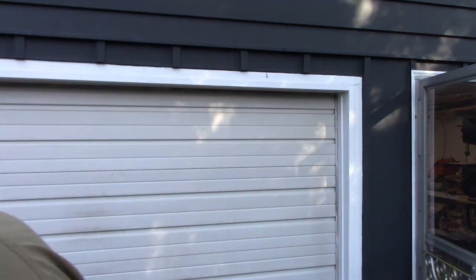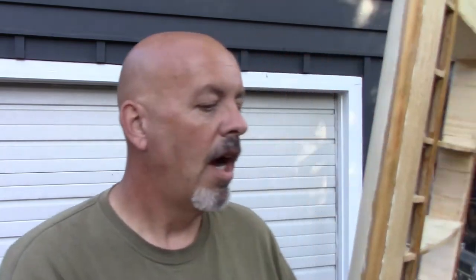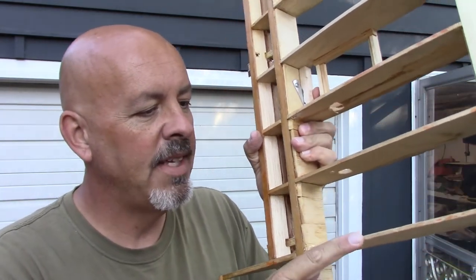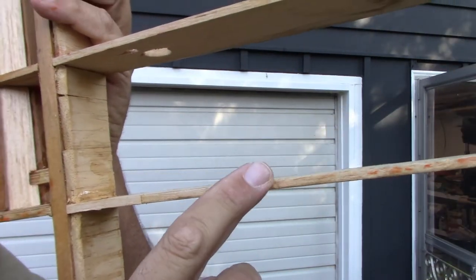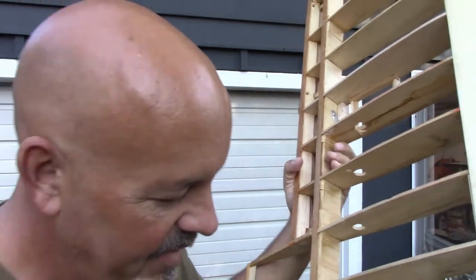The wings are all complete and taken care of. There are a couple little things I worked on — little pieces I wanted to do. I've got little teeny things like this, just a little tiny nick. I really don't want to cut it apart and put another piece of balsa on top; I may just throw a little bit of filler on top of that. So when I'm doing my final sand down, I'll go up one more time with some nitrate dope and we'll call it done. The wings are all done, ready to go. We're getting close.